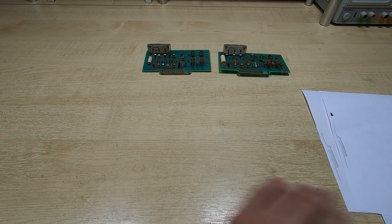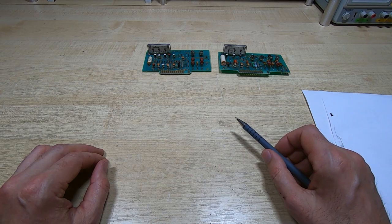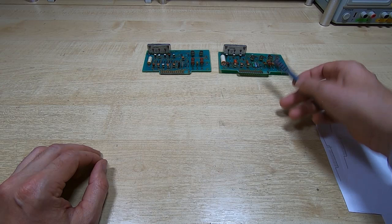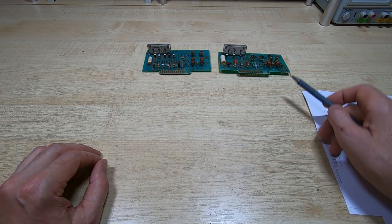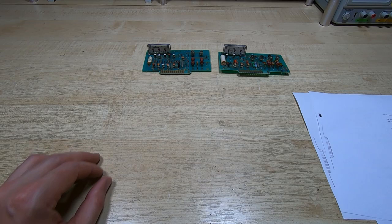Okay, so very straightforward, very simple, very ingenious, requires very few bits, and that's what's important with this machine because of the discrete nature. We can't spare lots of bits to have D2As or something like that. So this will give you an almost unlimited number of steps across the display without the need for additional bits. And also it's a very efficient way to draw the characters. So what I'll do is I'll mock up a very simple version of this circuit, and we'll see it working in a simplified format.